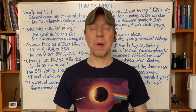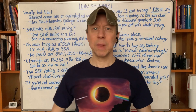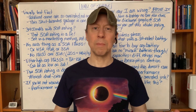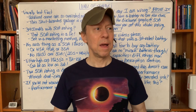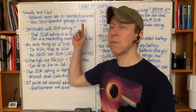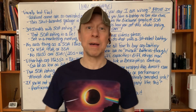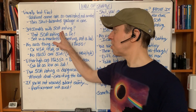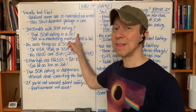Normally I'd like to test the batteries I put into the Hall of Shame because it gives me a better idea of what cells they might actually be using, but I'm realizing that some of them are so ridiculously overrated that they can go into the Hall of Shame without any testing at all — because they're impossible batteries. This skull-branded piece of garbage is one of them: 3400 milliampere hour with a 50 amp rating.